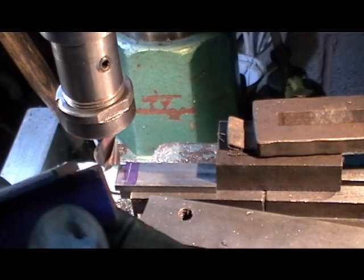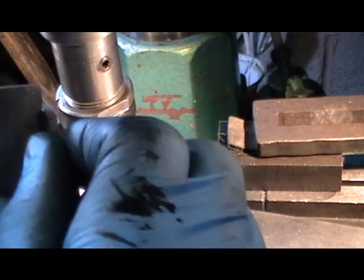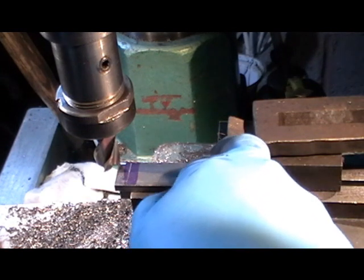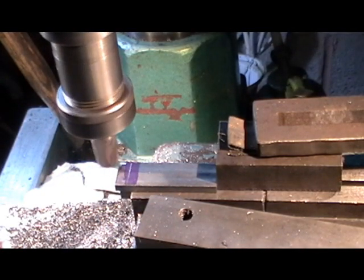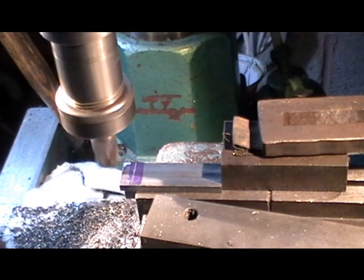What we've got to do then is cut this little notch in for the horn keeper. This is my sample and it's got to go down the depth of the flange and five sixteenths in from the end. I've set a stop on my vise. I'm putting the first one in now and setting it up - I've touched on to the top face. I'm going to move down, and you do it with either your dials, your digital readout, or your vernier, whatever you've got on your machine.